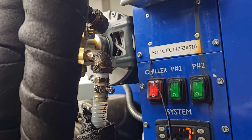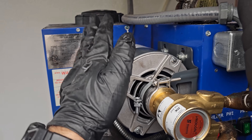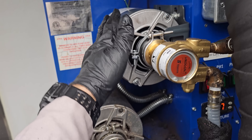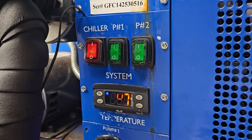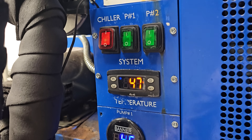It's been running for about five minutes — both pumps and motors. We still need to get a current reading on this one just to make sure we're not overamping. The pump is running at 5.4 amps; it's allowed to run 6.1. The other one's running fine too.